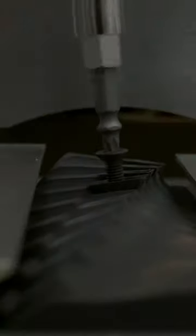Next I rotate the blades 90 degrees using my earlier marks as a reference to guarantee a new sharp edge is installed. I like to do this every 6 months or so, but your times will vary depending on how often you use your machine.